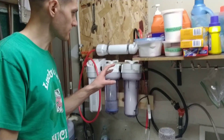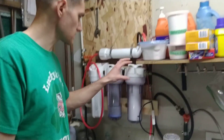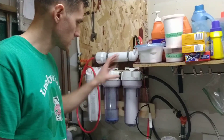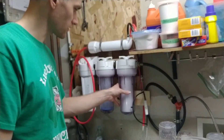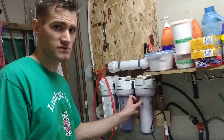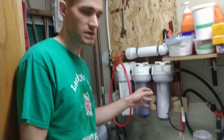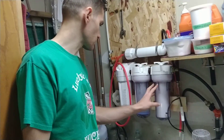I've got basically just these filter housings. This one's got a one-micron size sediment filter, so that's just removing the fine particles. Our pipes are relatively new so there won't be much iron, I don't think. So hopefully that lasts for a while.